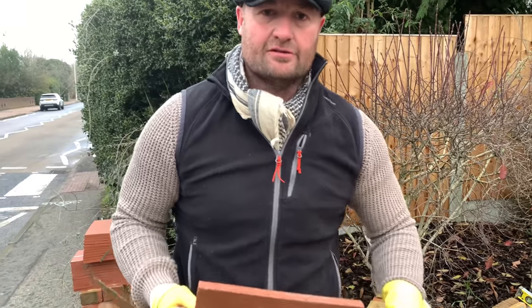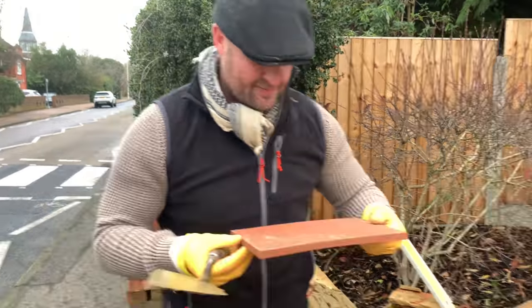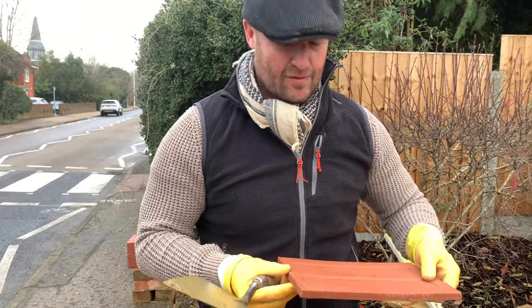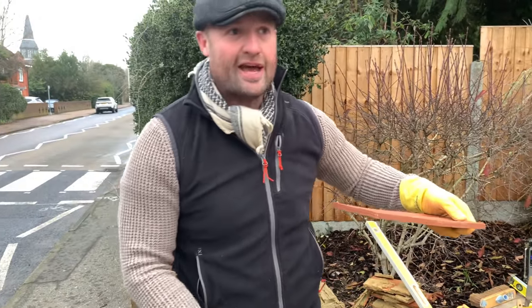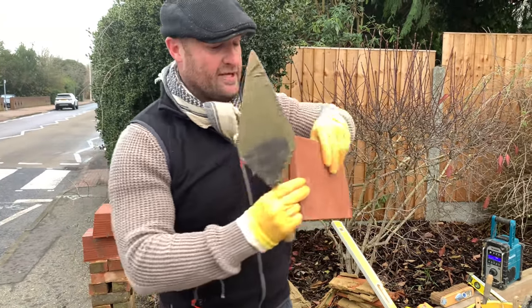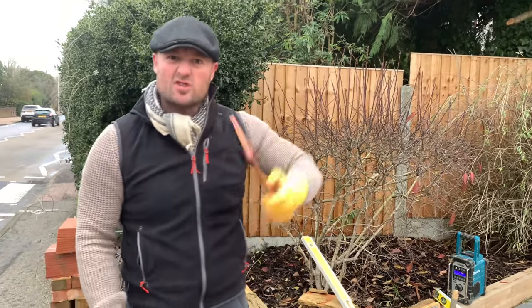Placing the first tile down, I've seen this so many times. When you place it down, people go, yeah, smooth, smooth. Put the first one smooth side down. Okay, the smooth side down. So, listen, I know it's a low wall, but if you do look up or anything happens, you've got a smooth surface on the outside, where people normally lay that one and you can see the ridge. Okay, so smooth side down on your first one.